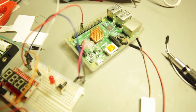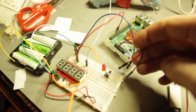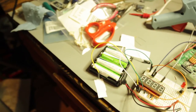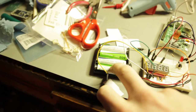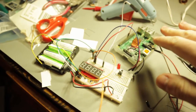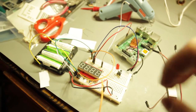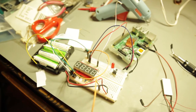Okay, check it out. Here's where we're at. Got the hot glue out, and I stuck the Peltier underneath the heat sink there, and just gave it some hot glue. I also put on some leads so that I could plug it in. Now, what I've got going on here is a battery pack that'll be about 5 volts, which will safely run the Peltier. I'm pretty sure I could run it higher, but I found they become less efficient from the resistance.